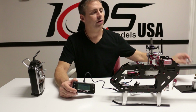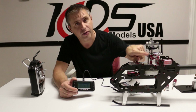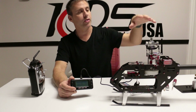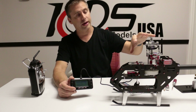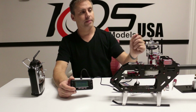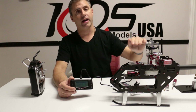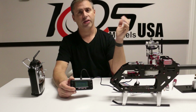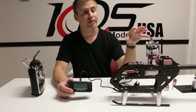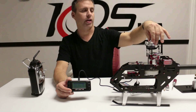At this point, you want to use a swash leveler. Drop the swash leveler on your helicopter and adjust your turnbuckles until the swash is perfectly level. Depending on whether you have a swash driver head or a direct link head, you may have to take the head on and off a few times. With a direct link head, the way to adjust your pitch for the most part is by moving your swash plate up and down until you get it pretty close. Then you can adjust the last degree or two with your pitch linkages. But you're going to try to get it as close as you can by moving the swash up and down. That may mean mount the head, take it off, mount the head, take it off, and the last step should be getting your swash level.